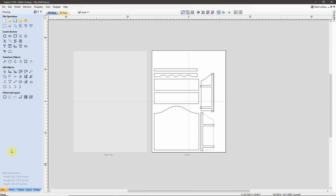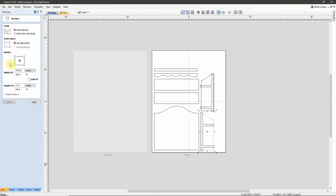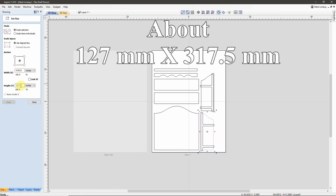What I'm going to want to do is select just the vector of my outside profile. Then I'm going to come back over to my Drawing tab and I'm going to check Selected Object Size. I see that my vector is 4 inches wide in X and 11.5 inches high in Y. I'm going to rotate this 90 degrees to sit on a piece of material, so I need to add an inch to this dimension — that's going to be my height in Y after I rotate it. So I'll remember 5 inches by 12.5 inches.